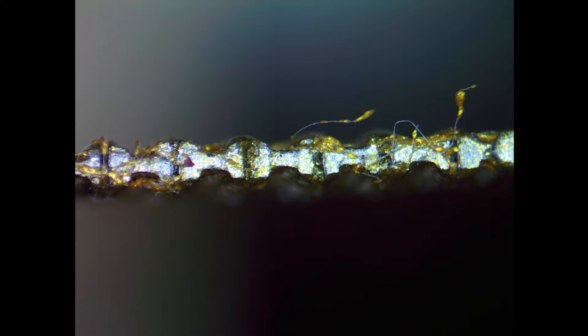What you're looking at is the side view of that new notched blade. We can see right in here that cut-open portion that is notched, and we have diamonds going all the way down here. Of course we have a bunch of gold paint which is causing a lot of reflection, but once we get over to the used notched blade you'll really be able to see it. We can see right in here a diamond, that's a diamond, diamond. So as the blade works down, you can get all the way down to here before the blade is worn out. Let's skip to the top-down view. Here you can really see it — we have those slits and that green spot right there, that's a diamond. This will run in stark contrast to the used notched blade.